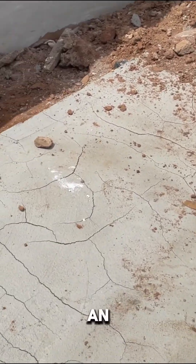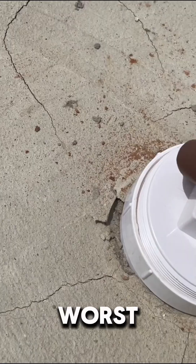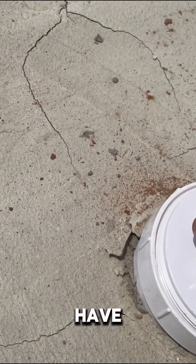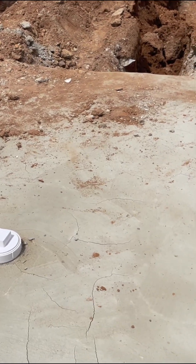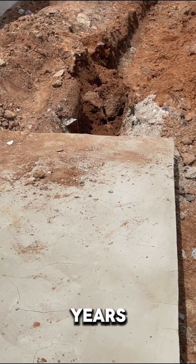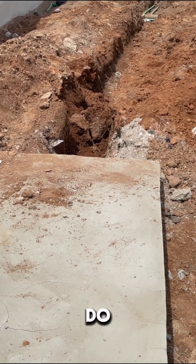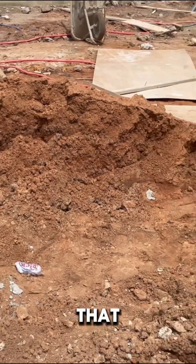In this situation, you should also give it access by putting a clean-out on the soak away, so that you can always have access to it. Worst case scenario, if it's not working effectively, you can have a small pump and have it pumped out and cleaned. That's what we decided to do. For all our projects, we insist on having a clean-out on each digester and soak away — it makes it easier for future use. If the whole place is covered, at least you know there's something you can always access.